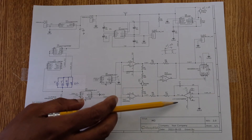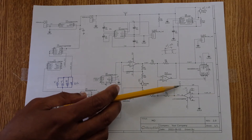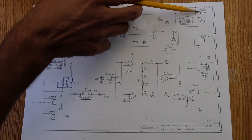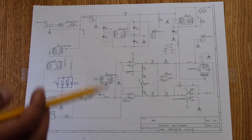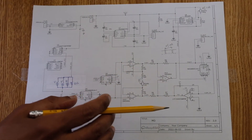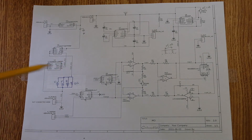The offset is sampled across capacitor C1, which is 1 microfarad. This can be increased to a larger value to hold the offset for a longer period. By adjusting this capacitor value and the update frequency, you can tune the system behavior with respect to decay or leakage on the capacitor. This is the core of how the offset cancellation circuit operates.